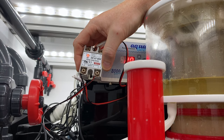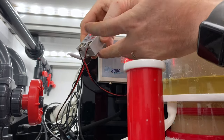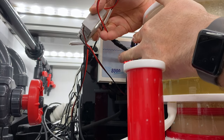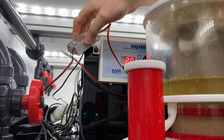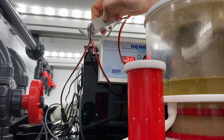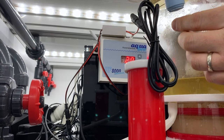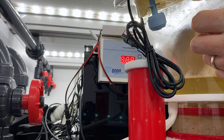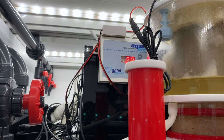We're in my cabinet — hence the echoey sound — and you can see I've got my relay here. I haven't mounted it in a box just yet, but the outlet comes down this way and plugs into my skimmer controller. The power that was going to my skimmer controller plugs in here, and then this power comes off through this little connector from my 12 volt power supply and goes off into my skimmer cup. It's a touch messy for now, but what you need to see is: I lift the float for the cup up — skimmer goes off. Let it come back down — skimmer comes back on. All that without cutting a single wire to the original skimmer or power supply — completely removable and transferable to the next skimmer.